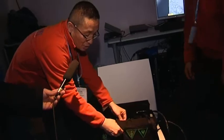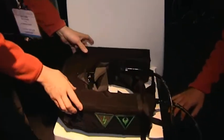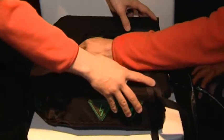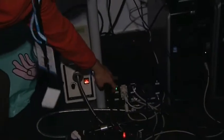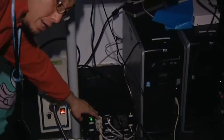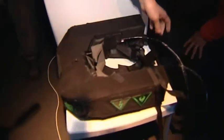We try to make it very light, so the outside shell is a kind of textile. But the frame is aluminum inside. And you could see that there are two rear projection HD TVs inside. So you could see here it's a light box. This is the left eye and right eye input coming from the computer. Here is the VR tools inside, feeding the VR tools the left eye and right eye information. Then here is a cable together with the optic fiber. So the light is coming from outside — you only have the display part.